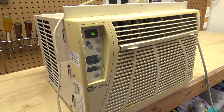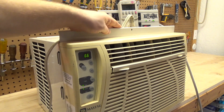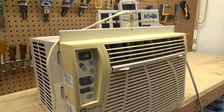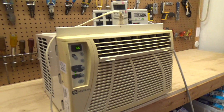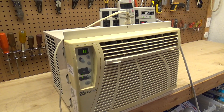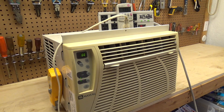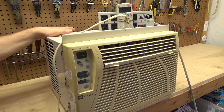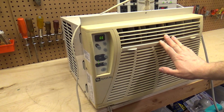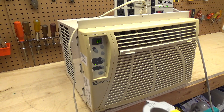The power draw is going up so the head pressure is building. We're allowed to run at 7.5 amps so it can go up plenty from where it is. The ambient temperature in here is 71°F. It's already getting pretty cold. There are some little rattles somewhere — that could be the capillary tubes; we'll check that.